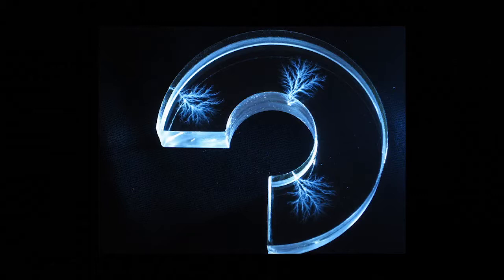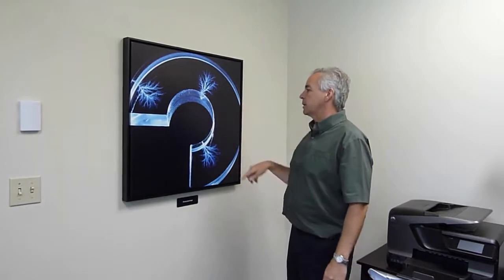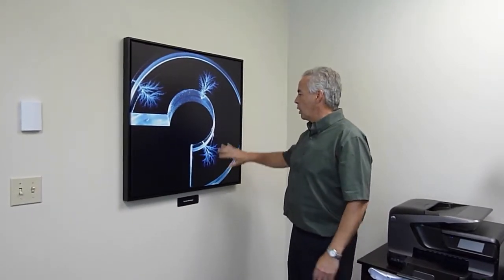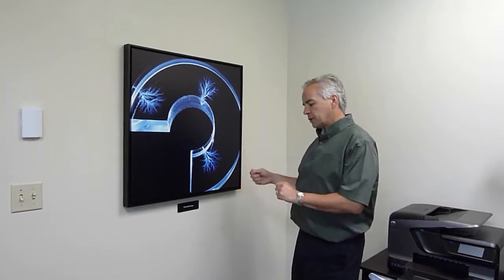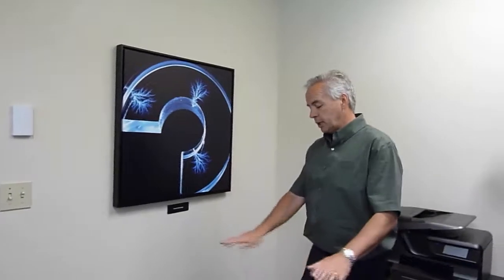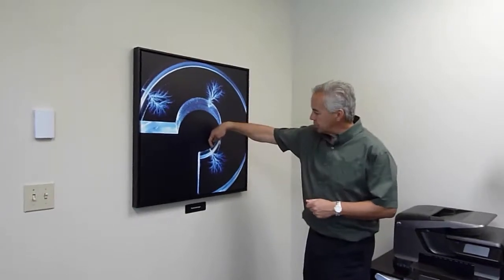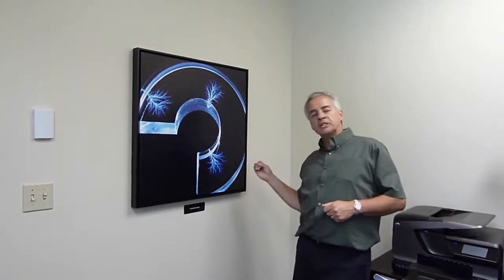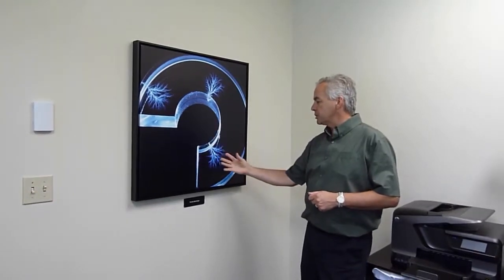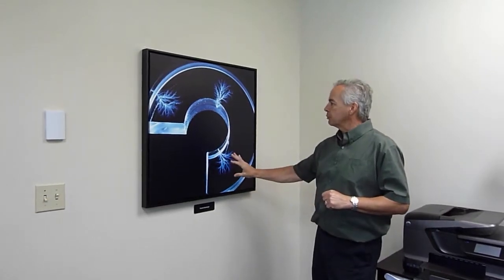So there are 3 trapezoids, and then you put it into this particle accelerator and you hit it with beta radiation, which is electrons at close to the speed of light. The electrons actually penetrate into the plastic because they're going so fast, and they get distributed where the metal's not blocking it. Then you take those, with hot gloves on, and you move those onto a dielectric surface, and then you have a probe that's grounded, and you touch the probe to that point right there, and all that space charge instantly discharges. It's instantaneous. This tree structure, this fractal tree structure, is formed.